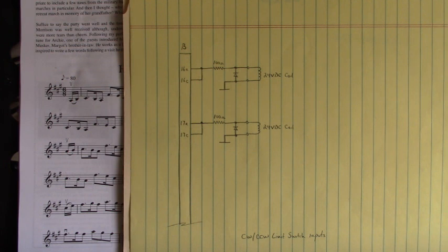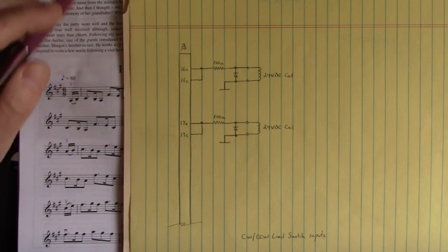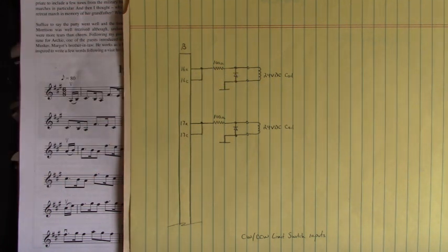What are those limits used for? Well, let's say you have a table moving in and out based on which way that DC motor is rotating. If we hit a limit switch that opens up, disables, disconnects that 24 volts DC from this relay coil right here, when we hit that limit switch and open up that circuit, that motor stops.